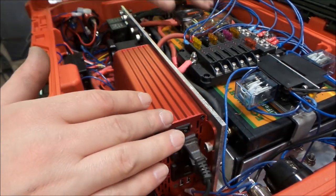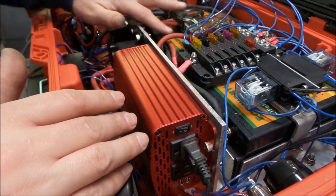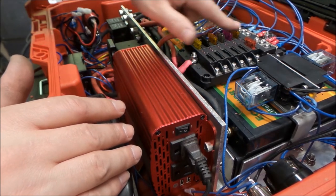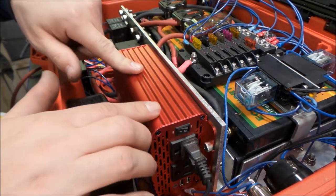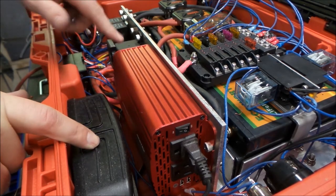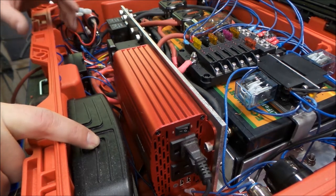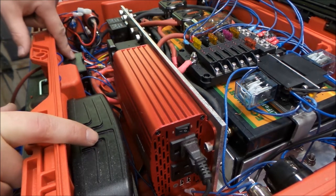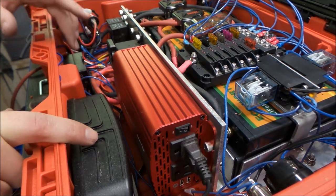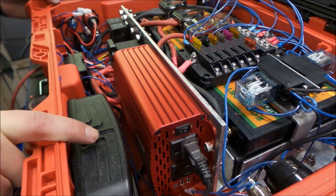We have our 12 volt high current side right here, and we can kind of move the camera around a little bit. This is mainly our 12 volt distribution stuff here, all the fuses. Here's our inverter. You can see our charger here. Here's our main contactor for the inverter. Our two secondary relays for the other bits. Here's our receiver for the remote relay function that we got.